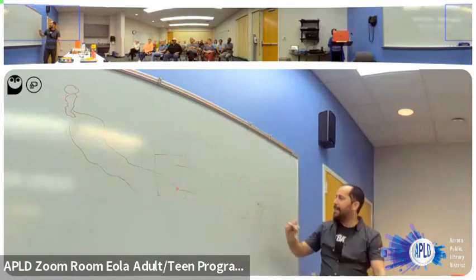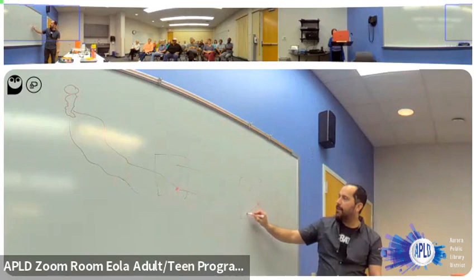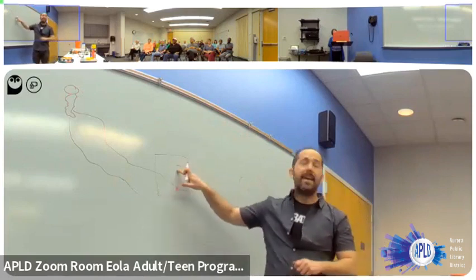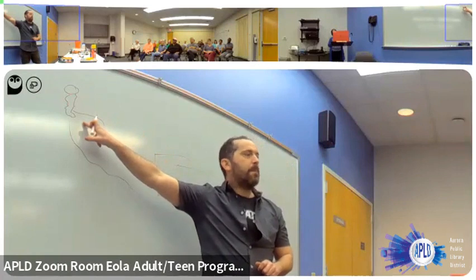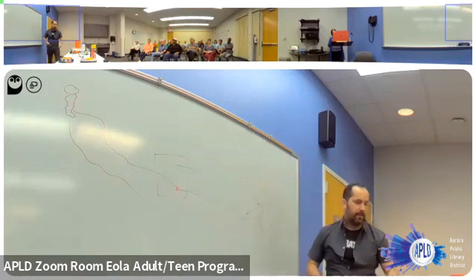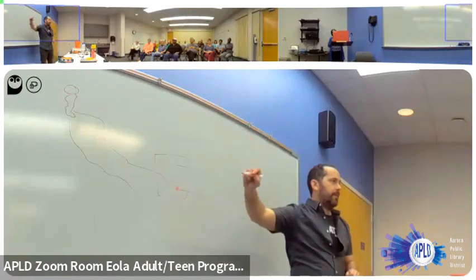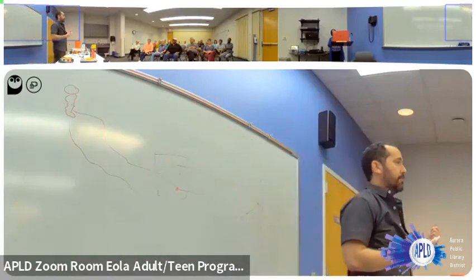What that implies is that this here has connected somehow to both wires, because this does nothing anymore and you can still get power. And this, whether I turn it on or off, turns this on momentarily. My suspicion is that what has happened is inside of this box, something along the lines of a wire nut has come loose, okay? And what you've done is permanently connected this circuit, and that the switch or the light or something is sensing the ground.